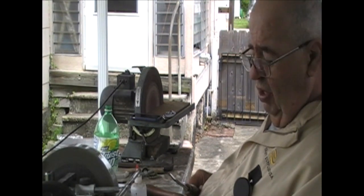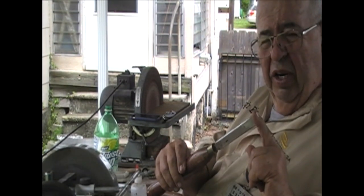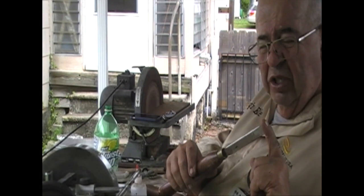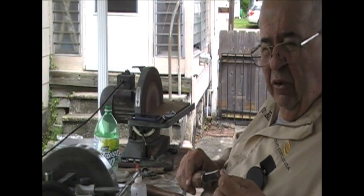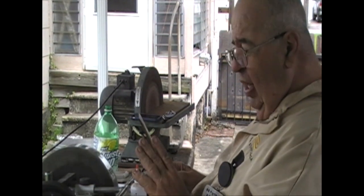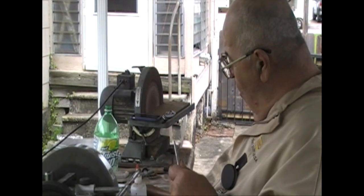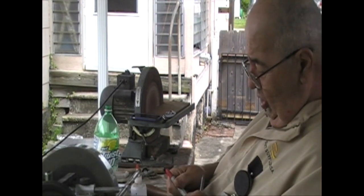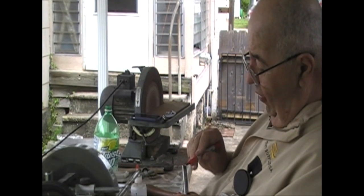That's a fingernail gouge. This is my skew. The angle on my skew, this angle here, matches the angle on my jaws. So when I do a pocket cut for my jaws, it matches up. You'll see how that is when I do the jaws. I don't normally regrind this and only take it to a diamond stone. But I'm going to do it again to show you how little material this moves and how efficient you can be.